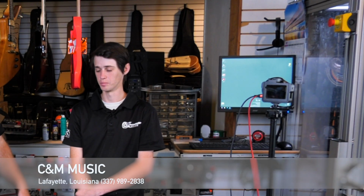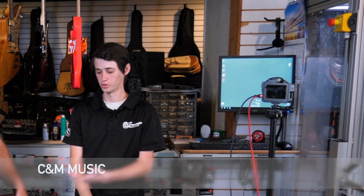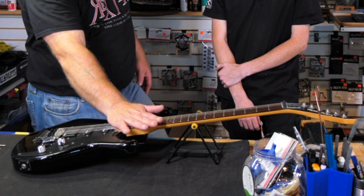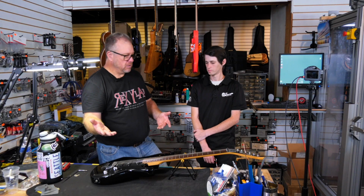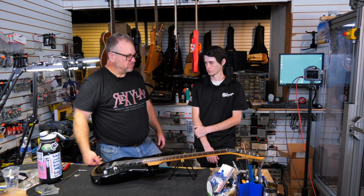What does it do? Fretwork, very well. It does fingerboard planing. It can make a bone nut from a blank, very well. Saddle cutting, you can do dot inlays. The use we use it for is fret cutting. Anything that's not on the fretboard or the nut, it doesn't do. No, it doesn't do soldering, neck adjustments, shimming. It doesn't do any of that.